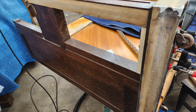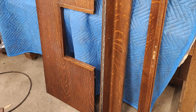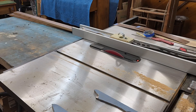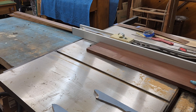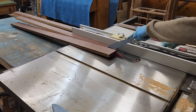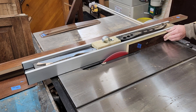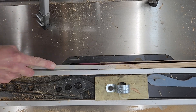For the most part, what had to be done on the right side of the cabinet had to be done on the left as well. With all the old damaged veneer off of the piano and the repairs made, it was time to find — or harvest — salvage some pre-owned veneer from pianos that gave their lives to save others. After cutting the pieces to width, I sliced the veneer off of the donor parts using the table saw set at a very narrow cut. This worked out pretty well.